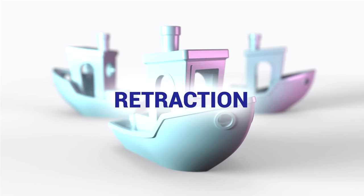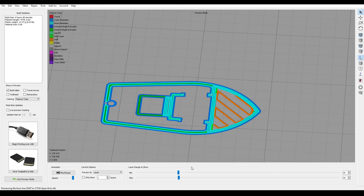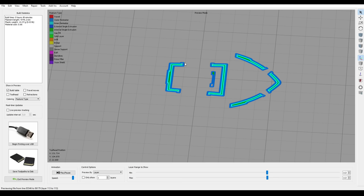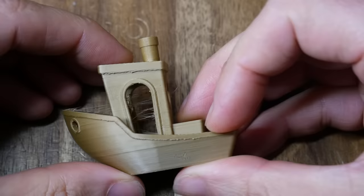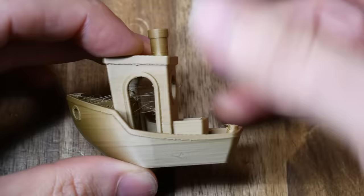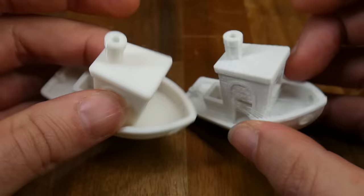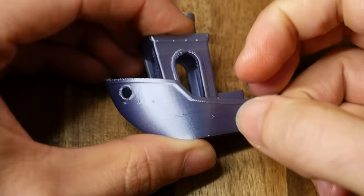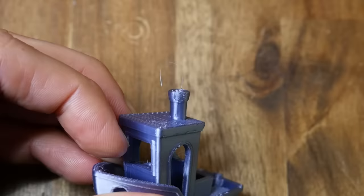Next up, we're going to examine retraction with our 3D Benchy. At the start of the Benchy, everything is one connected surface, but as we get a little bit higher, the print will start to separate into islands. Near the top of the print, we actually have multiple distinct areas where we need extrusion and then retraction in between them as the nozzle moves to the next area. Here's an example of when the retraction is pretty much perfect — you can't see any stringing, particularly inside the cabin. And here's one that's not so good — there's plenty of plastic that's oozed out of the nozzle as it's moved to a new area, which we call stringing. If the stringing is bad enough, your Benchy gets a free set of Venetian blinds across its windows. Another relevant thing to talk about are the zits on the layer changes — on my best Benchy they're pretty much non-existent, but if yours are bad, they'll be greatly exaggerated on the top of the chimney, indicating some tuning to be done in the slicer.